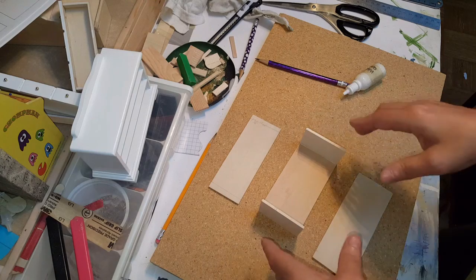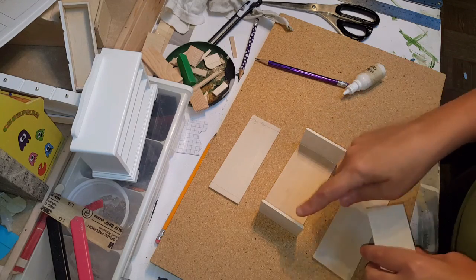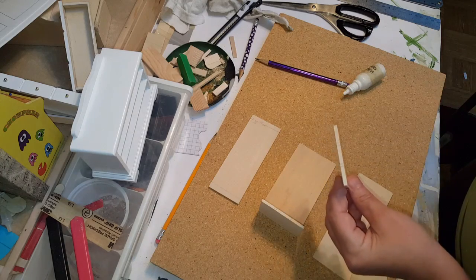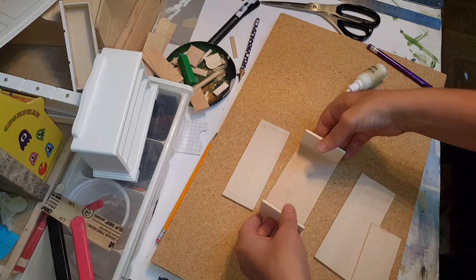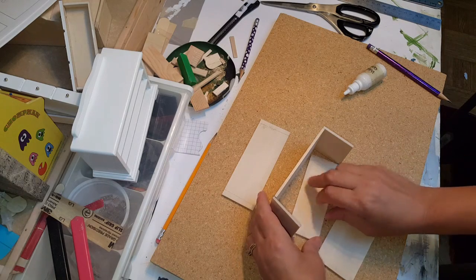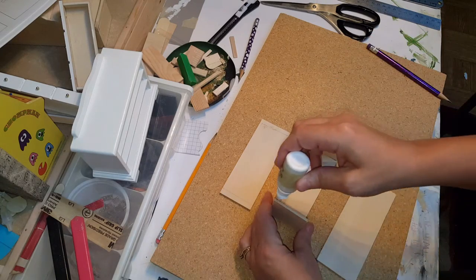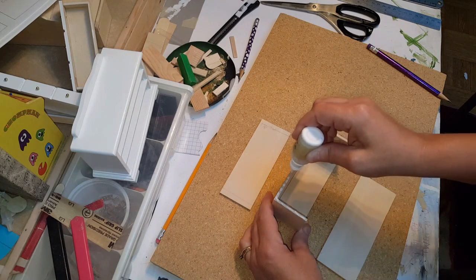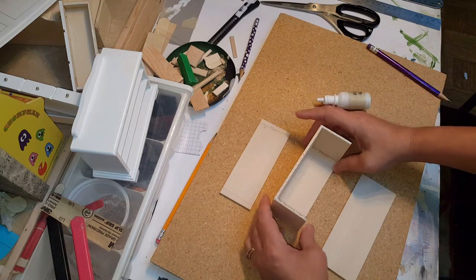You can use some masking tape to help hold it if you like. I have my middles marked right where I'm going to be adding my drawer. Now I need to lift this up and I can use a middle in here just to kind of keep it as a spacer — just don't let it dry itself to it. I want to apply some glue all along the top, and if you're working with an end grain — the area that you cut freshly — you're probably going to want to pre-glue it and wipe it off to let it sit.